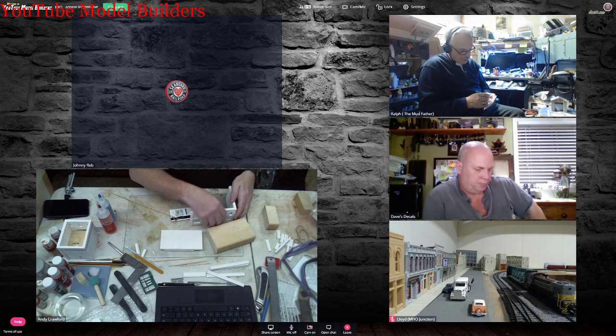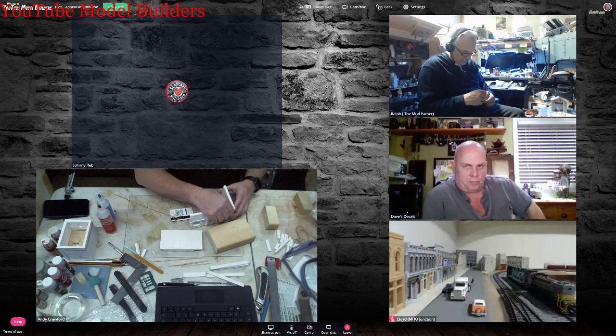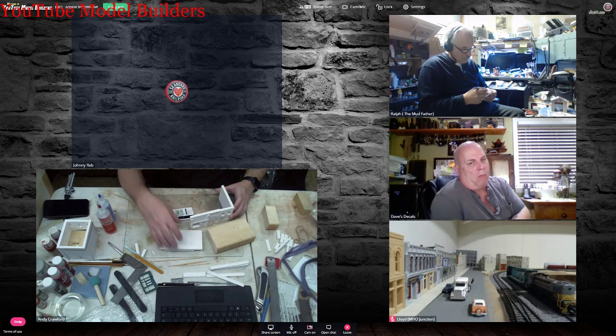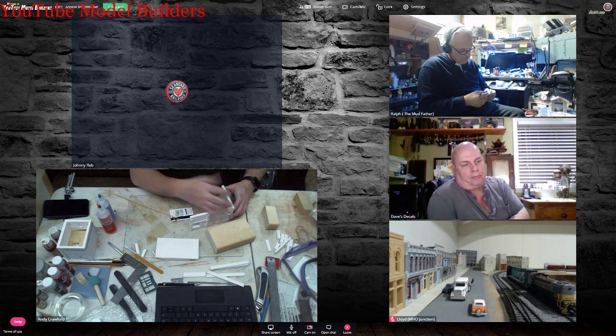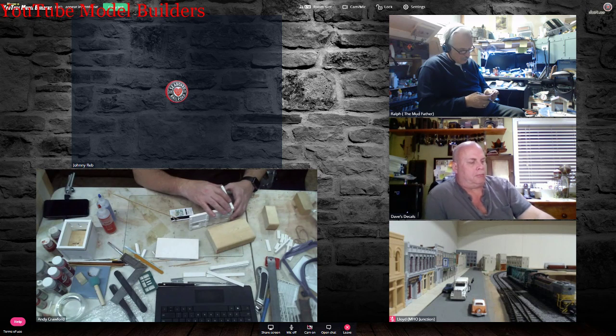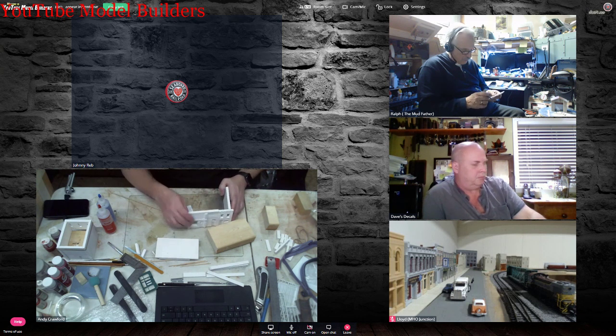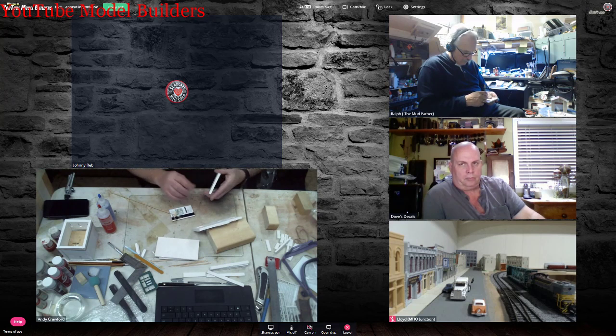And actually, the difference in a lot of these paints is talcum powder. You can add talcum powder to paint to thicken it up, kind of like cornstarch in cooking processes. Talcum powder has a similar effect in acrylic paints anyway. A lot of paints you buy, like chalkboard paints or very, very flat paints, are just about always paint with a bunch of talcum powder added to it.